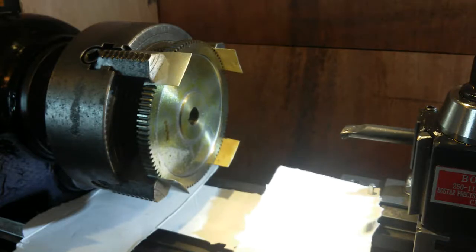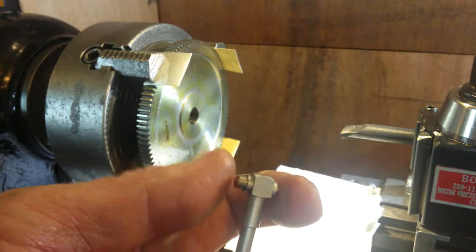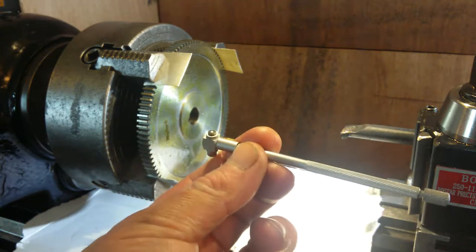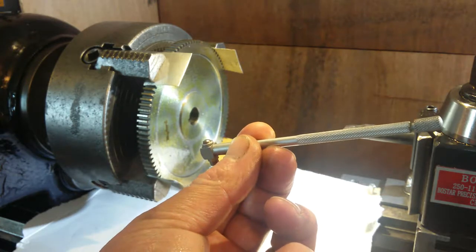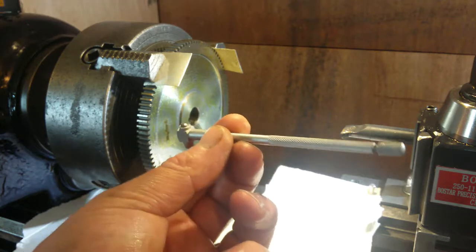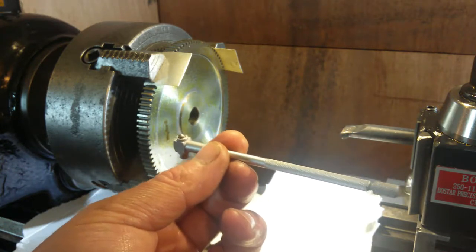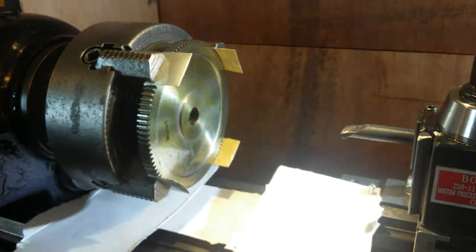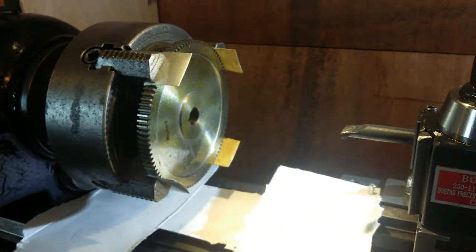And as I was pulling it out, you feel the resistance as it comes out. If you don't feel resistance, just do it again. You put it at an angle, the two telescoping ends, they'll be longer than the bore is wide, because it's not parallel to it, it's at an angle, so they'll be longer. You tighten it up at that, and then when you drag it out, you'll feel resistance. Now, I dragged it out a little bit, cocked it up a little bit, put it back in again, centralised it, and then pulled it out, and I felt resistance on the way out, so I'm very happy I got a good measurement. Obviously, you always double check your measurements.